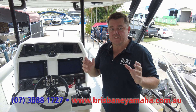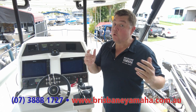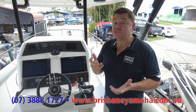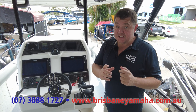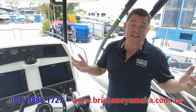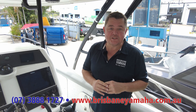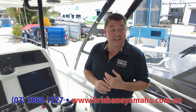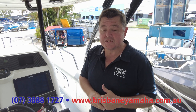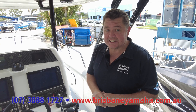The customer's comment on these motors — we won't mention what brand came off — was that the boat now performs the way he always wanted it to perform. He'd been trying four-blade props, trying all sorts of things to get this thing to sit where he needed. Yamaha's T-Series props straight off the bat. The only thing we found was that 7-inch pitch would have been nice, but we were touching the rev limiter at over 80 kilometres an hour in swell with 7s. We're going to go to 8s and sea trial it again and possibly even go to 9s. The boat will top out well into the 90 kilometre range now.